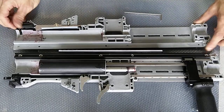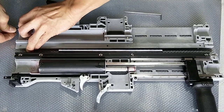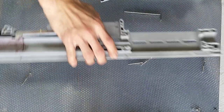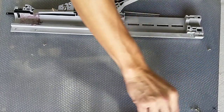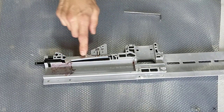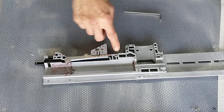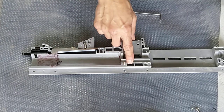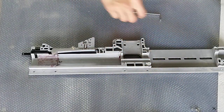You can actually remove all these. There's another area here as well — let me move this aside and have a look. All these are screws that drop off once you remove them from the base of the blaster. Now if you look at this part, this is actually the sear. The sear is linked to an M3 nut here so the spring doesn't come off, and this is what controls the movement of your trigger mechanism to the plunger system.